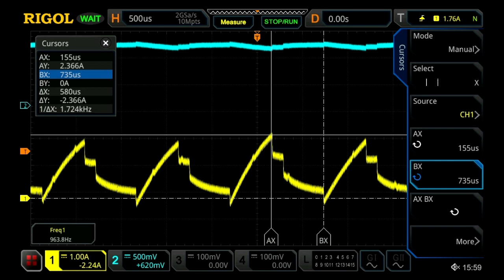When reproducing our signal, we're going to set our amplitude to go from zero amps to 2.3 amps. Then we're going to set our slew rate so that it's slightly faster on the rising edge and slower on the falling edge. Since it's roughly the same sort of signal, we can actually use the continuous function on our electronic load.